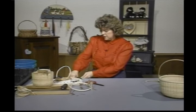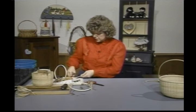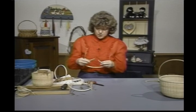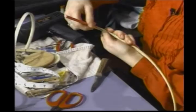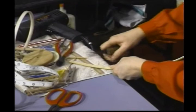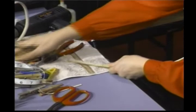Some type of a shaver or a plane works very well too. See how I've gotten that thinner and thinner? It actually could be a little bit thinner on the end. As I bring this other end around, I need to shave the back end, so I'm going to the reverse side. I'll make my pencil mark so I can see it on the other side and know exactly where to start, then shave this one down the same way — getting thinner as I go out.